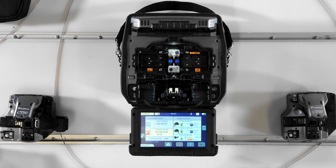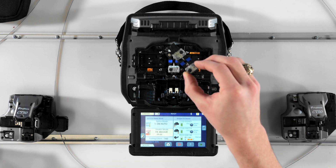The grooves are perfectly aligned with one another, which allows them to passively align the fibers together. This alignment mechanism, however, leaves the V-groove susceptible to dirt, dust, and debris, which can build up over time and affect fiber alignment, which is why the 90R comes with a set of spare V-grooves.